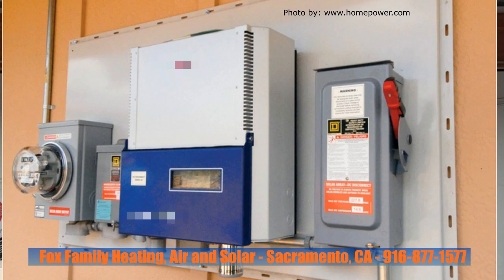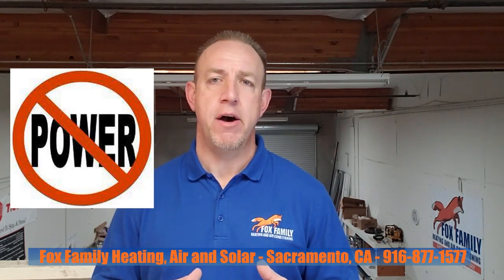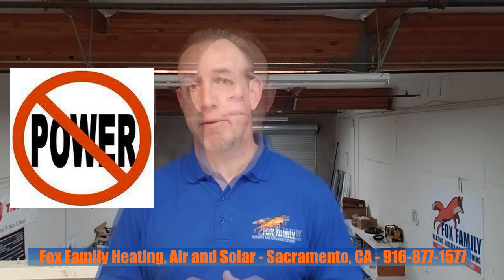Solar panels get all the glory, but it's the inverters that do all the work. Central string inverters, let's say ones that came before 2018, used to manage the conversion of DC voltage to AC voltage that you can use for your house. It did that for the whole solar panel system. That meant if one panel went down, the entire solar panel system would go down.